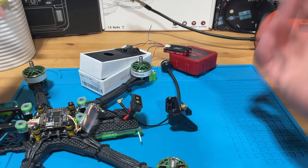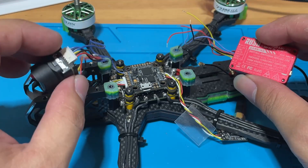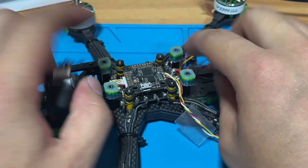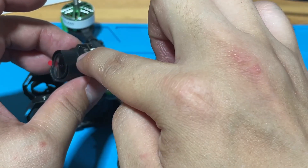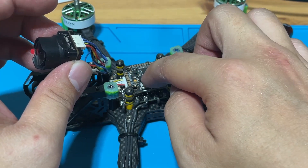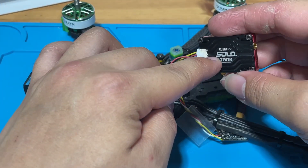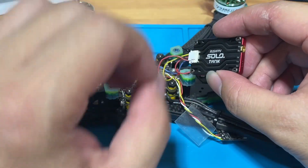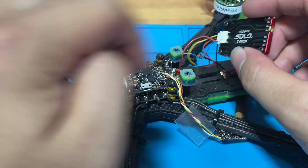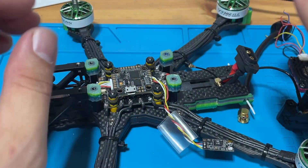These together are often referred to as a VTX system. The most common connection method is to connect the camera and the VTX separately onto the flight controller. The camera receives signal and sends it into the flight controller. The flight controller processes it, adds OSD information, and exports it out to the VTX. The VTX then broadcasts that signal to our goggles — so signal flows in and out. Next, we'll look at the wiring diagram for the camera and the VTX so we know which pads we need to solder.